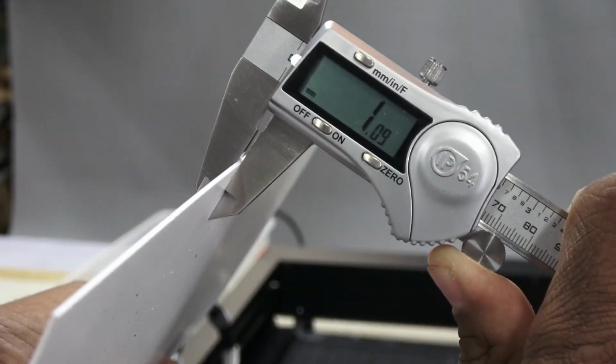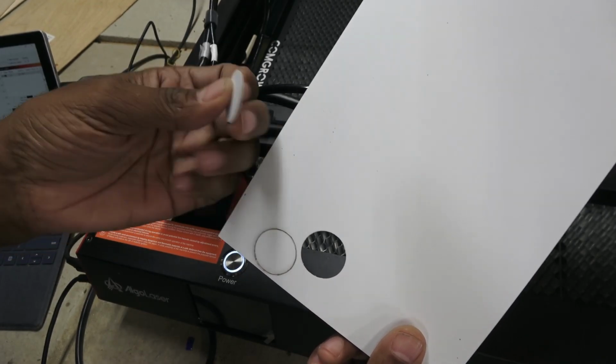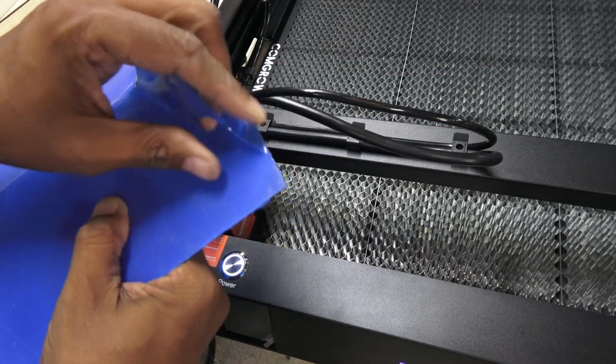I was also able to cut through 1mm thick styrene. But that seemed to be about as thick as the laser would do. I had some, what I think is, 1/16" clear acrylic, but it only cut the protective sheeting. Well, I did a quick bit of research, and it turns out that diode lasers are the wrong wavelength to cut clear acrylic. So it looks like that's going to be a no-go for me on acrylic, unfortunately. Oh well, you can't have everything.